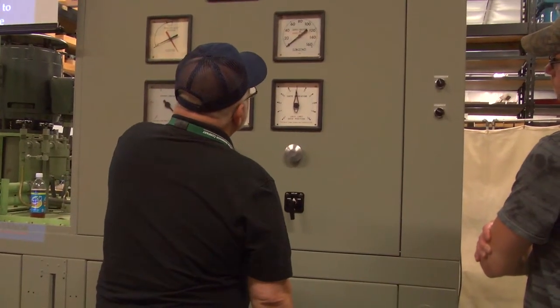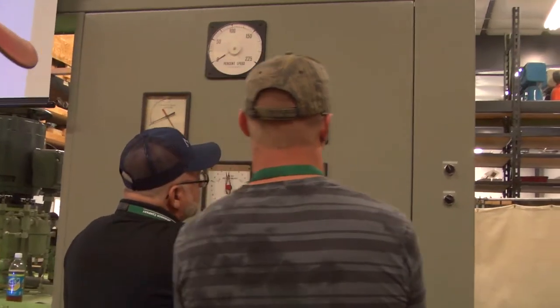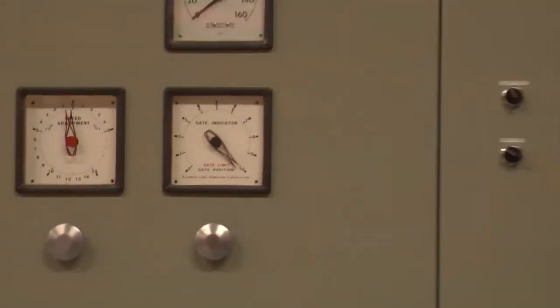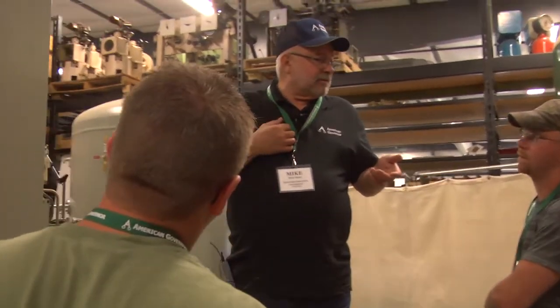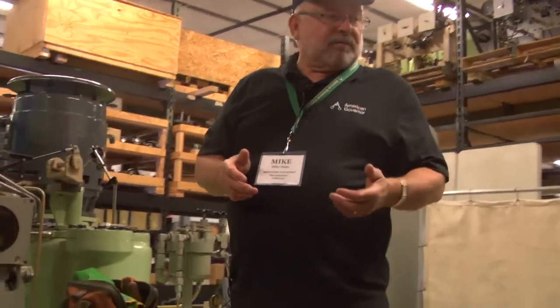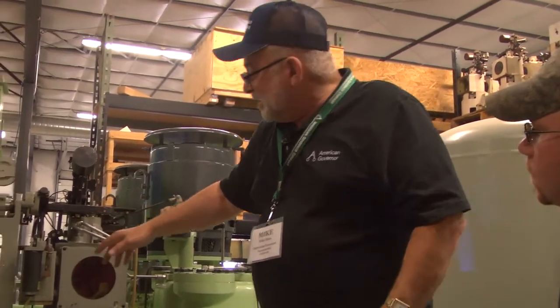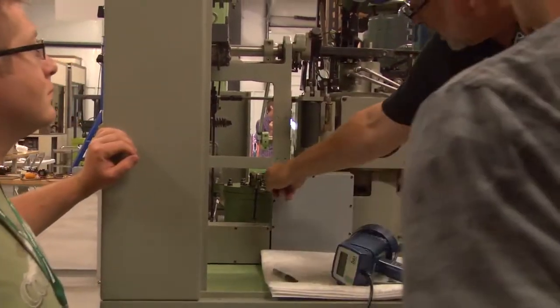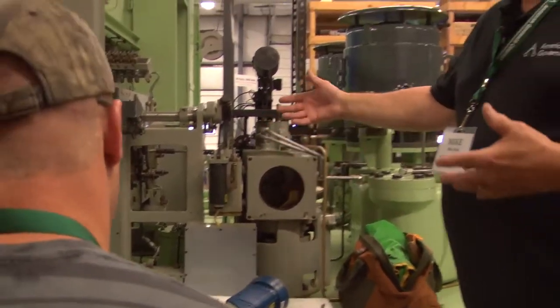Oh, no, no, no. Excuse me, you're half of 100. 50 dead on, isn't it? Yep. They're set to close like that, 0% in the wall. Because we didn't mess with that. But if that was messed up, that's the blessing of doing the auxiliary valve. If the auxiliary valve stroke was off, this machine, because it's set up like we have it, that was just like doing the main valve. If you had the auxiliary valve stroke off, you would just shorten that little rod there, for the stroke. But the adjustment we did was actually on the main. Gotcha. It's doing the main adjustment for the dials.